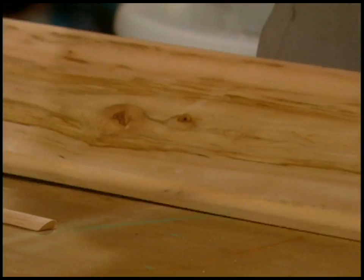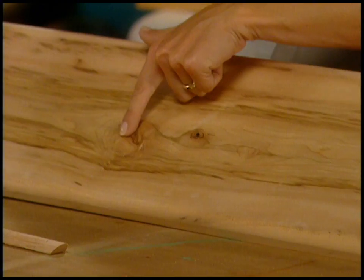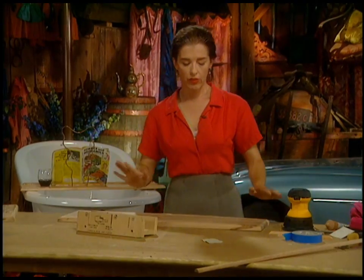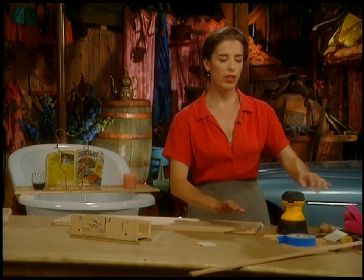The whole surface has been sanded with 220 grit sandpaper. If you want to go crazy and have a baby fine finish, you can go up to 600 grit — it's like hardly even sandpaper anymore, just kind of a rough cloth, but it makes it really smooth. There are a few little pock marks in the very middle of the wood, but they just add character. Before I do any filling, I want to cut the trim.